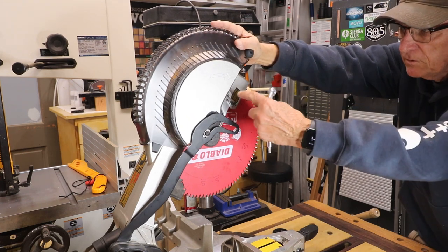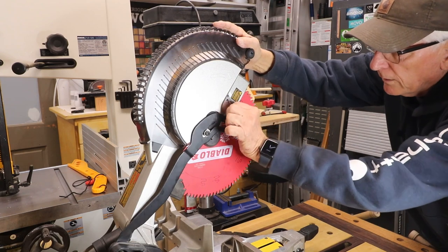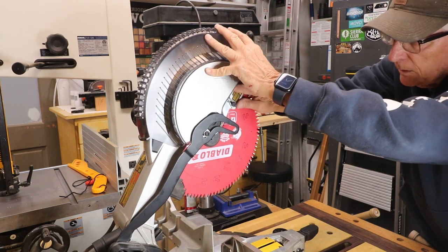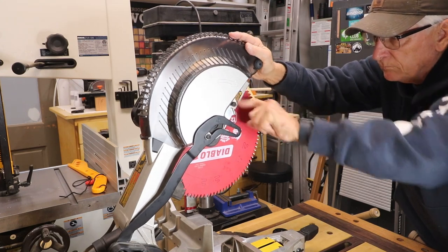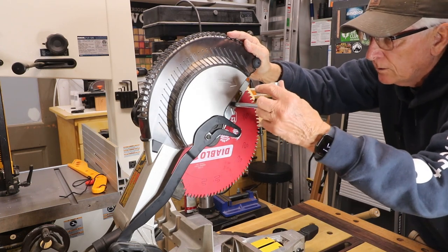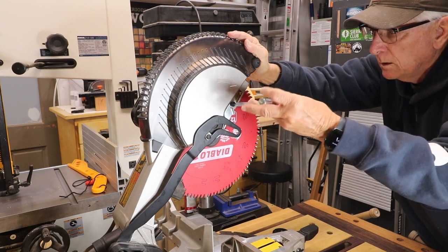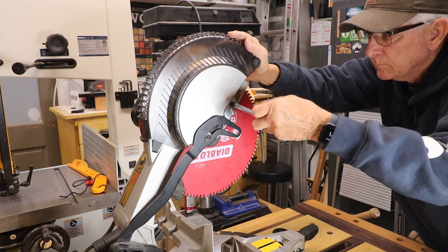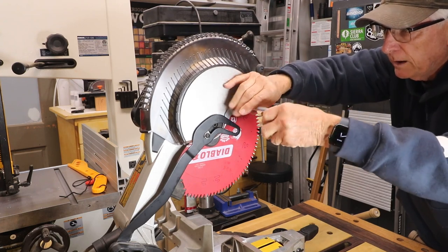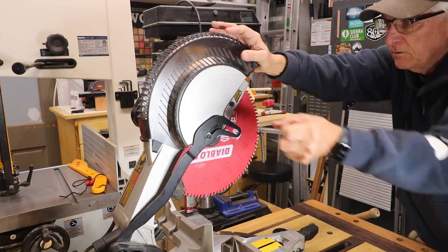Next we just need to drop this guide back down. So I want to pull that metal piece — I might have to use a pair of pliers to get a hold of it. Oh, there we go. So I bring that down over that bolt and tighten that bolt back up. Which way do we tighten this bolt? Well, this is a traditional normal screw, so we tighten it by going clockwise. We tightened the reverse-thread arbor nut by going counterclockwise; we tighten this one back up the traditional way, which is clockwise. Got that nice and secure and there we have it.